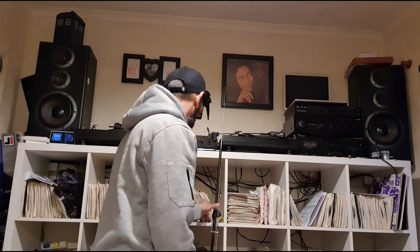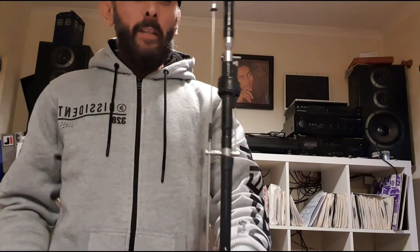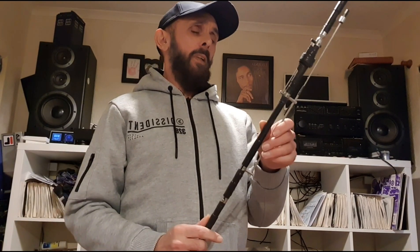Of course there are other options. If you fancy a multi-band antenna, you might want to consider something like this beast. It's getting slightly big — taller than myself, I'd say probably a seven foot tall antenna, six and a half feet something like that. But the good thing about this particular antenna is it's a multi-band antenna. It works on 40 meters, 70 centimeters, two meters, six meters, 15 meters, 10 meters — obviously not 20 on this one — and the 40 meter band on the large full section.